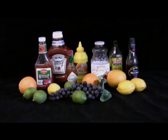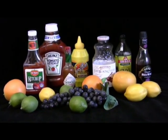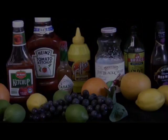It is important to protect the countertop from staining. Vinegar, wine, fruit juices, and grease can all badly discolor a concrete surface. Single component sealers like acrylic concrete sealers, and then densifiers, waterproofing agents of various sorts, and penetrating products, including waxes, are usually not sufficient protectors against wine and other food stains.